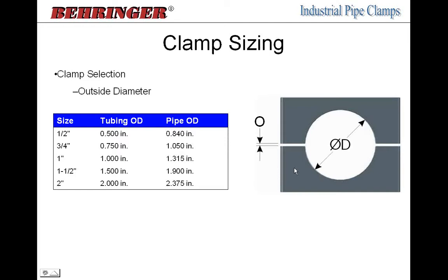Now for sizing — the most important thing to understand is the difference between tubing and pipe. For example, a half-inch tube has a half-inch OD — tubing is always rated by its outside diameter. Pipe, on the other hand, is a nominal size: half-inch nominal pipe has a nominally half-inch inside diameter. With wall thickness added, the OD of a half-inch pipe is 0.84 inches. All half-inch pipe regardless of schedule will have a 0.84 OD — there's a large difference between 0.5 and 0.84.